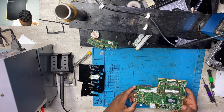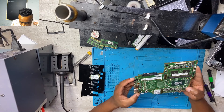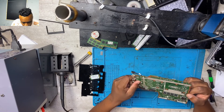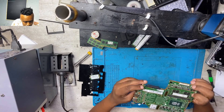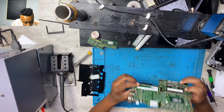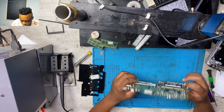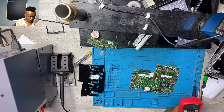I'm from KZN and he's from Limpopo. Normally what I do, I prefer to do a physical inspection. I always advise you: before you do a motherboard repair or a board-level repair, always start with the basics — first thing, you need to do a physical inspection. When I repair a board I will take the motherboard, look around everywhere, look for any suspicious components, and I was flipping the board all over and couldn't find any suspicious components.